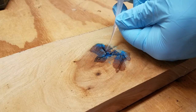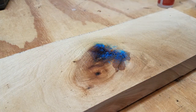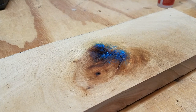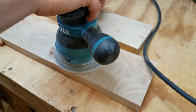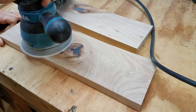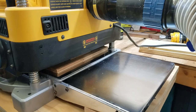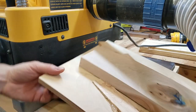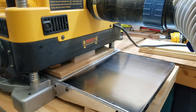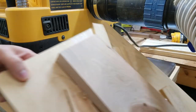Using these is pretty simple for the gap filling stuff. You just put a thin layer down, then take your accelerator and spray on top. Wait about 30 seconds to make sure the catalyst has finished accelerating the chemical reaction, then put down your next layer of glue and repeat. Once you've got it built up to the height you need and the knot is filled in, you can sand it down level with the wood — I used 220 grit. You can also plane it; it held up well and didn't tear out, though it might be a little hard on the knives since it's a harder material. I did both sanded and planed.